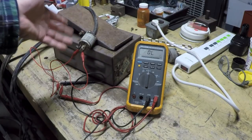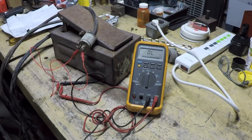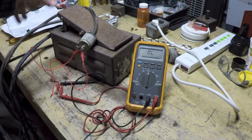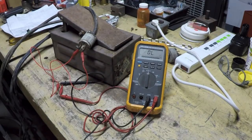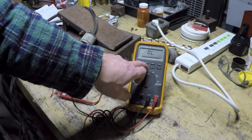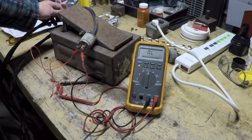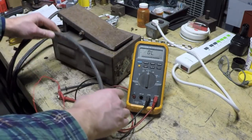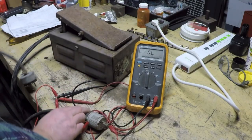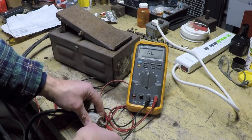That's actually pretty darn low. What I'm measuring is all of this cable, the electrical resistance of this entire cable, and any connections inside there, and that's all pretty normal. The other thing you can do, not a bad idea, again maybe with the continuity checker on, is place the cable in proximity so that we don't knock the leads around, like I just did, and knock the alligator clip off.